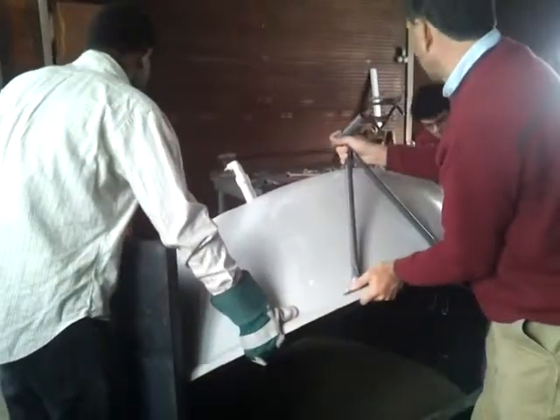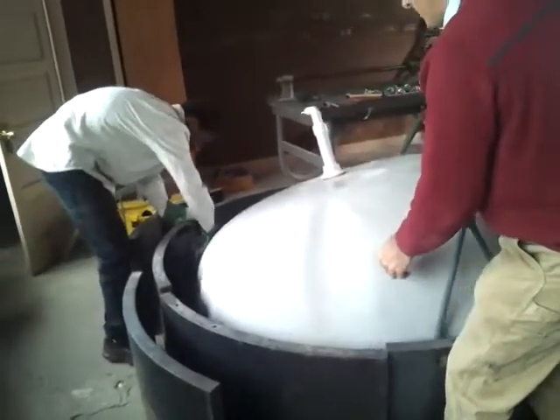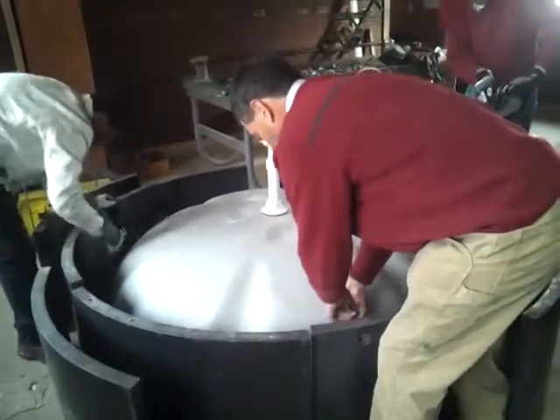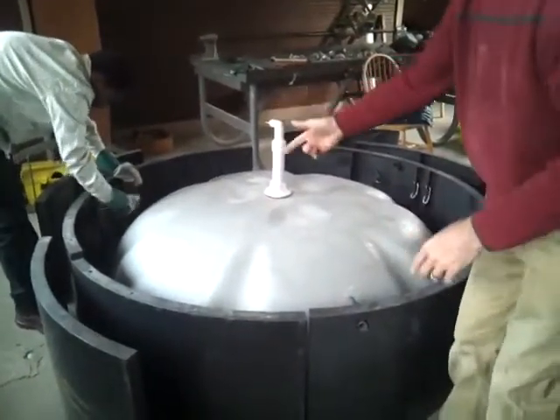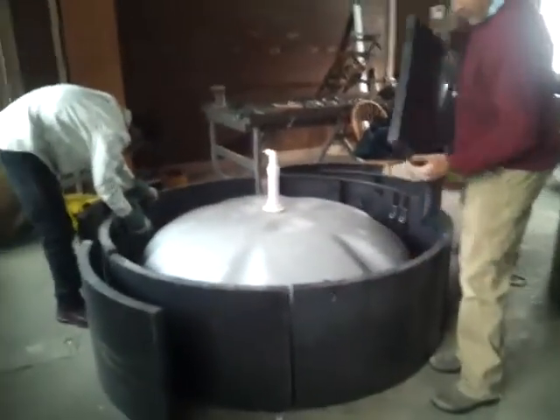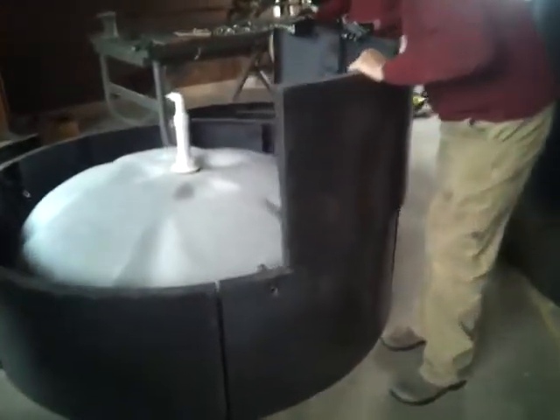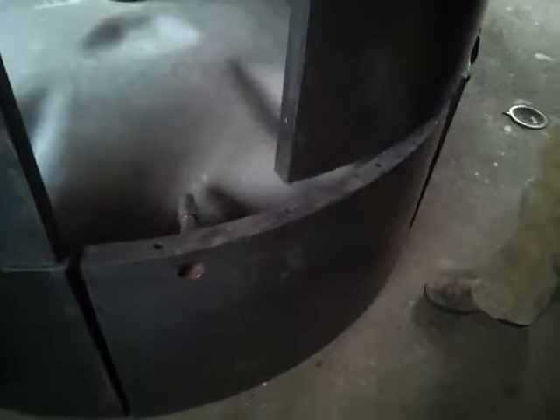So when we put it back down, let's lay it down again. When the cement is poured, this will be anchored into the cement like that. Note that the holes are on the bottom here — there are holes on the top too. That's why you join these plates together, but you always do it over a gap. You never put a plate over a plate like this — that would be unstable. You always put a plate over two other plates, and that joins them together and leads to stability. Like bricks — exactly like laying bricks.